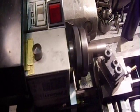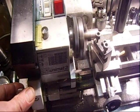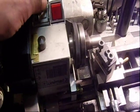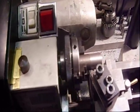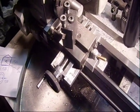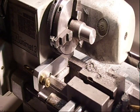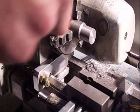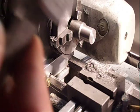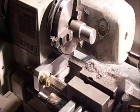It's enough — it's a little bit more than necessary. Okay, so I just go more down and I will come back when it's almost 40 millimeters. Now it should be around 13.8, so I always leave one tenth of a millimeter for grinding down and for the final finish. Okay, next step is to make the hole center.